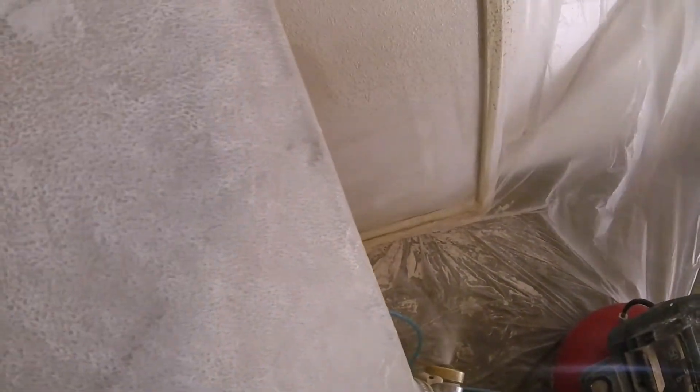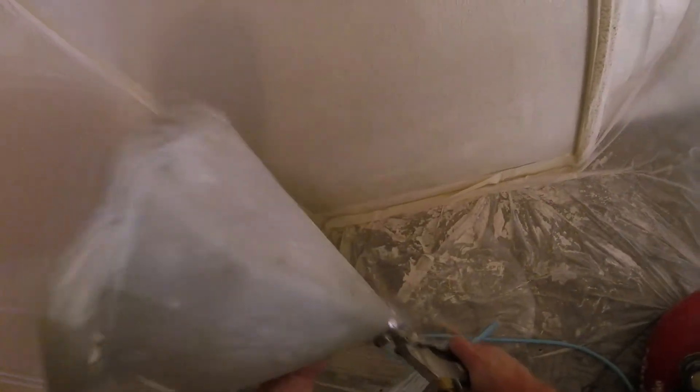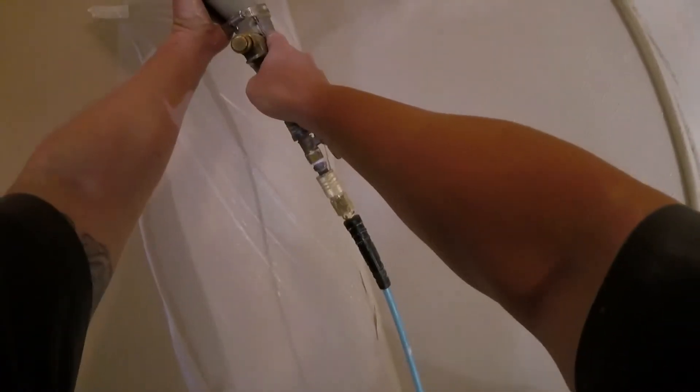Once you get everything sprayed in one direction, you want to follow through with the opposite direction. Since I went horizontal on this spray pattern, I want to cross it off and go vertical. You also want to spray extra detail around your angles, around your baseboard, around your trim — those are always light spots in the texture. Sometimes guys like to turn off the valve on the hopper, let the air compressor build up, then open it full pressure and do a diagonal spray to fill in any light spots and give it a nice, consistent pattern.